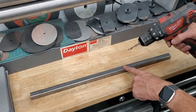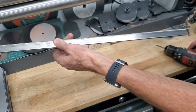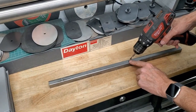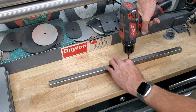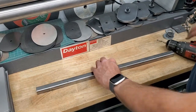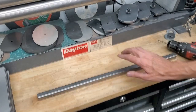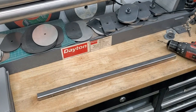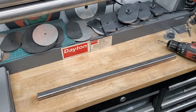Normally when you're trying to drill holes through square tubing like this — this is a 3/4" square, 16 gauge — usually when you're trying to drill a hole through it, even if you get the hole perfectly in the center on the top, by the time you get down through the bottom, usually you poke out on an angle or something. If you've got a drill press, that makes it a lot easier. But since I have a CNC machine here, the Tormach 770, I'm going to see just how fast I can knock 16 of these out.